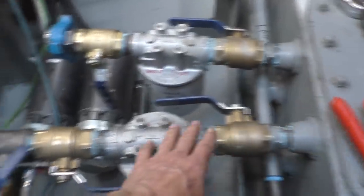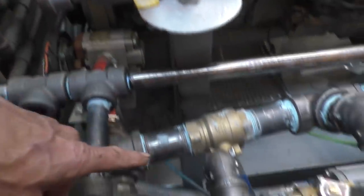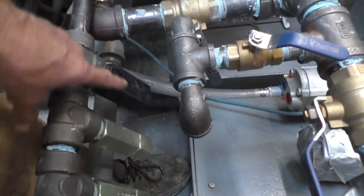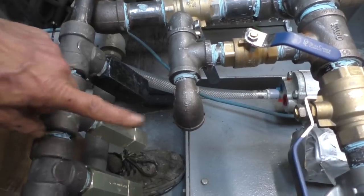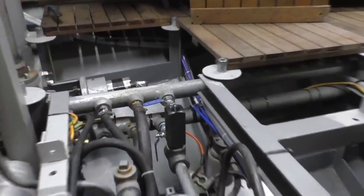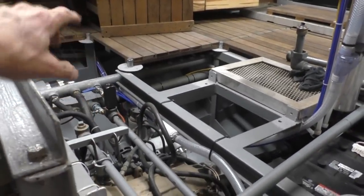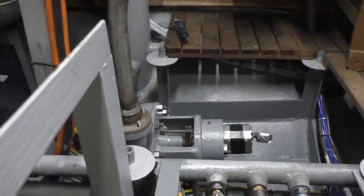But here's all you really need to know. Remember the three pieces of this. It's the supply from the tank out to all the pumps. Two pumps there, one pump down and around the corner that way. And then from the pump, there'll be a high pressure hose that comes back out. And all of our high pressure hoses run through check valves. So fluid can flow up from either of those two pumps through these check valves and into the system. But if those pumps aren't running, there's no way for the fluid to go back down to any of these pumps. There's three check valves here because there's one, two, three pumps. And there's another check valve around the corner over there. See that thing standing up there? So fluid goes down through that from the VMAC pump, which will sit in this area here, the whole machine. So everything gets supplied. That one's over there because there's a T there because the line needs to go on across and feed that motor that drives that pump over there.